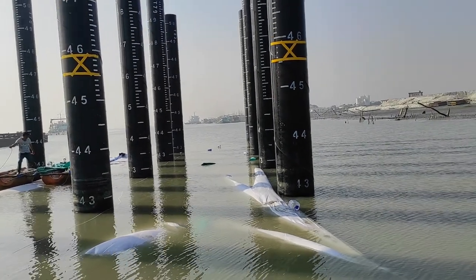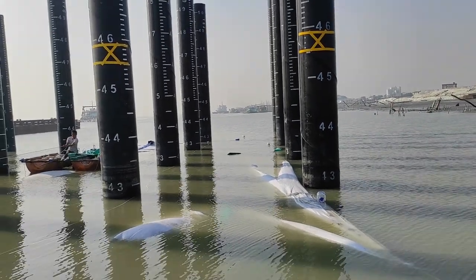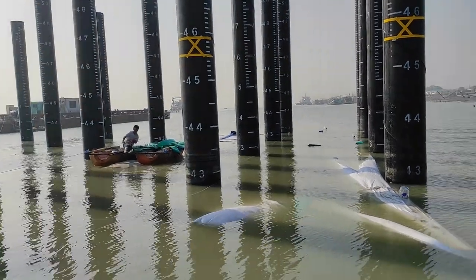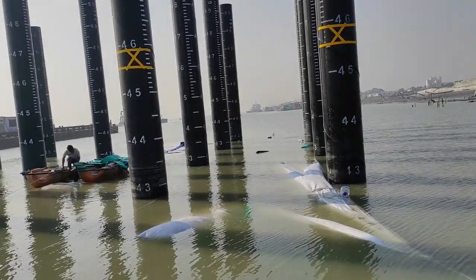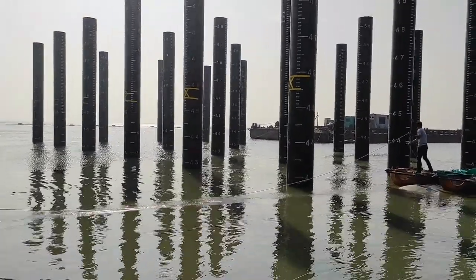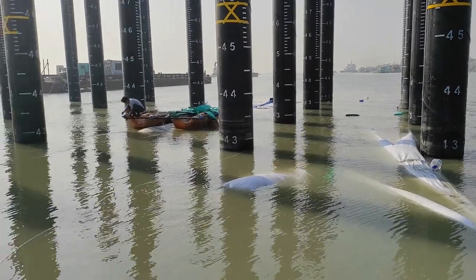As you see, we did the geobag manufacturing work before at our manufacturing area. After manufacturing is complete, we bring it to site and place it like this. Because of the high pressure pump and water, the bag could float away if we leave it. That's why we anchor it by rope at the fourth corner side. Then we can fix the position, and start filling after checking the coordinates at site.